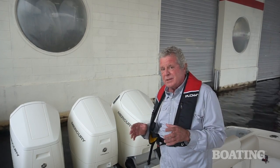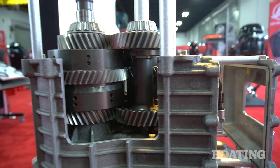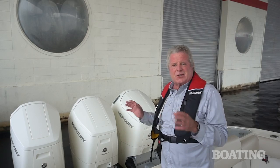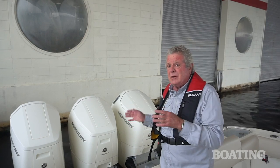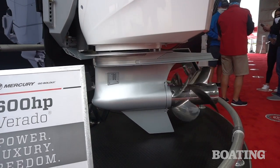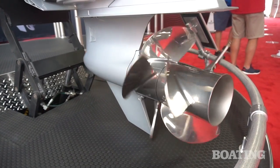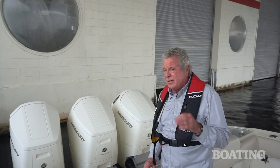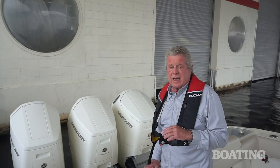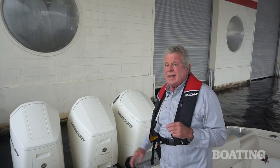There's a very cool thing here — this motor is built with a transmission in it, and it's two-speed: a 2.5 gear and a 3.0 gear. As you get up to redline on your RPMs, it'll downshift, give you more power, more thrust, and more excitement. As you spin the wheel, you'll notice the motors aren't turning at all — all the work is happening below the waterline. Mercury has invented a connection to this transmission that lets the gear case down below turn without missing a beat on the dual prop propellers. There's also an exhaust bypass — these are probably the quietest motors I've listened to. At idle in port, the exhaust bypass brings the exhaust out above water; when running through the water, the exhaust goes down below. It's always quiet and always efficient.